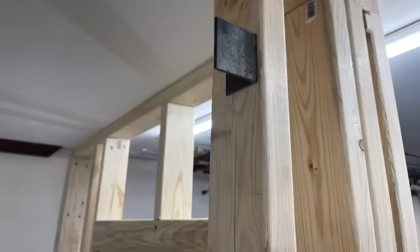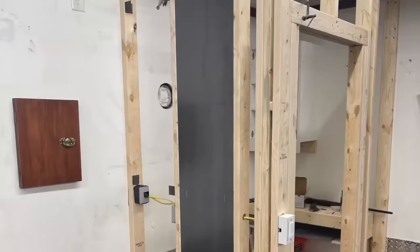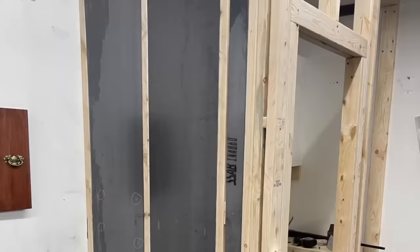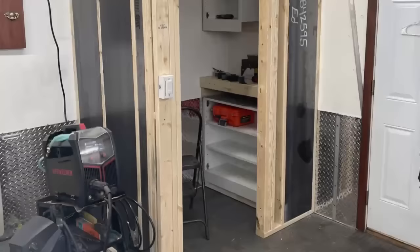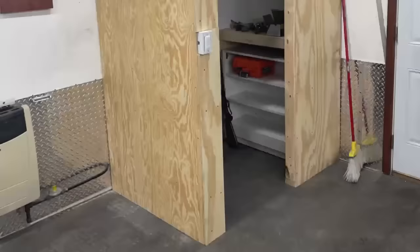In these next few pictures, you can see I've got some angle iron screwed to the studs. That's because I lined in between these studs with quarter-inch steel plate — this is obviously going to be a vault, and I don't want it to be easy to break into. Sheetrock simply wasn't going to cut it. So in order to put these quarter-inch steel plates in between the studs, I had to have some way to affix and fasten them, so I put those angle irons in there and then I quite literally welded them to the quarter-inch steel plate to make a very rigid and durable wall. There's no way anybody's getting into this thing with anything short of a cutting torch or some major tools.